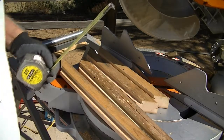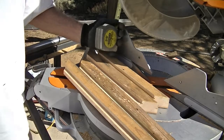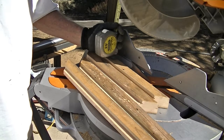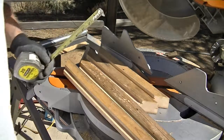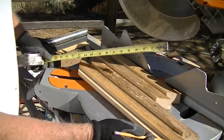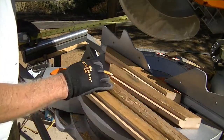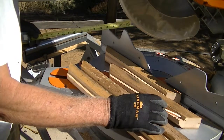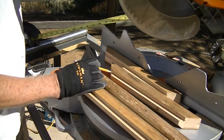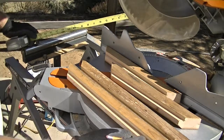I'm on the last one of all those 10 or 12 that I had set up ready to go. I've cut the 45s for this one. I just wanted to show one thing I mentioned before: I am basically making the picture to fit the frame. But if you have a picture that's an 11 by 14 and you want to make a nice frame for it, in order to measure that out to make your frame pieces, say for instance you'd want to be 14 inches from here to here and 11 inches from there to there — it's this point right here where your picture is going to sit up against the inside of the inset. So you've got to make sure that this area right here is a little bit more than 11 by 14, or 12 by 16, or 8 by 10, or whatever.